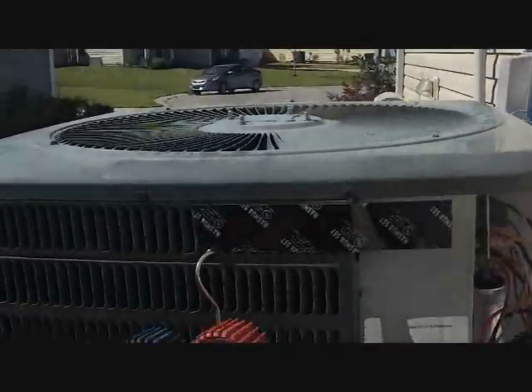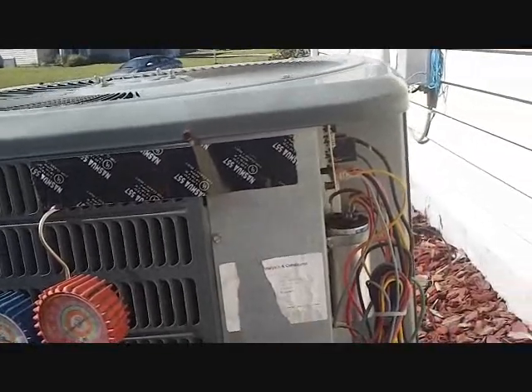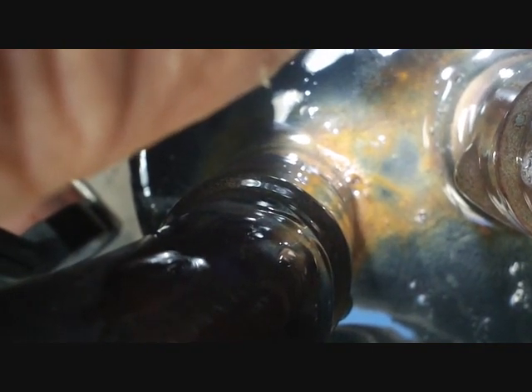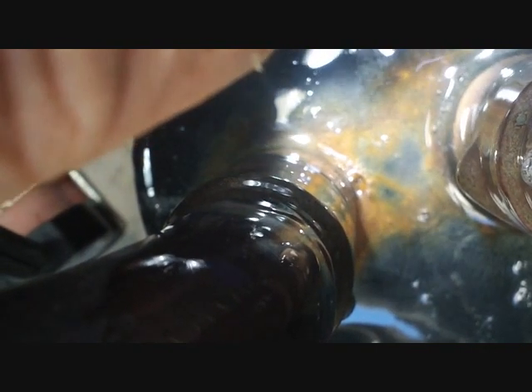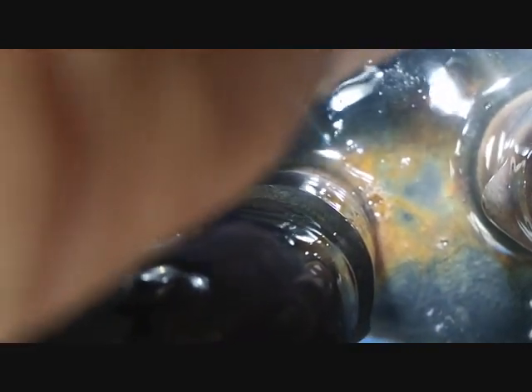It's hard to see down there at the accumulator, but at the base of the accumulator there's a bubble that's growing — that's bad news. It's quite large now. So what we have is a very small leak on the accumulator going toward the reversing valve, at the inlet port. But it's getting larger and larger.